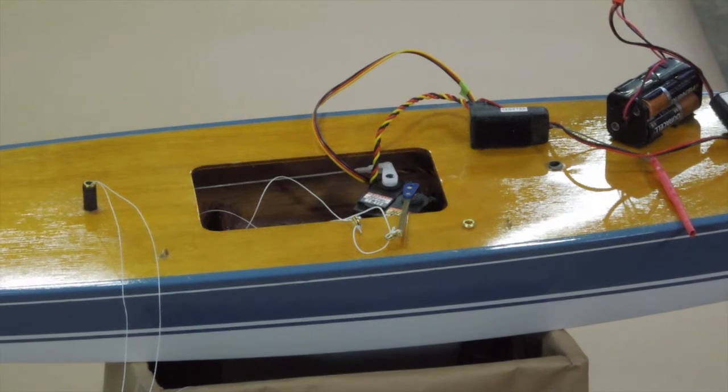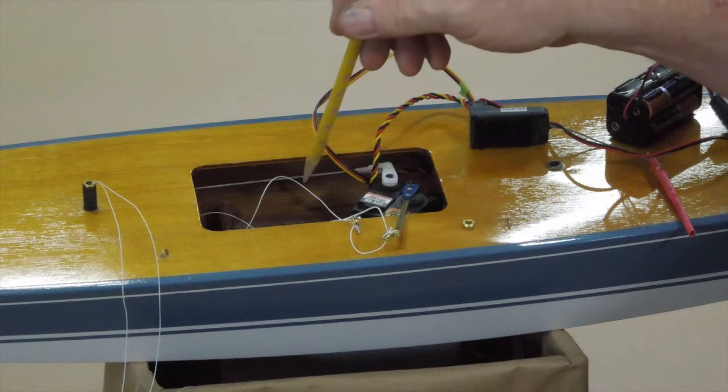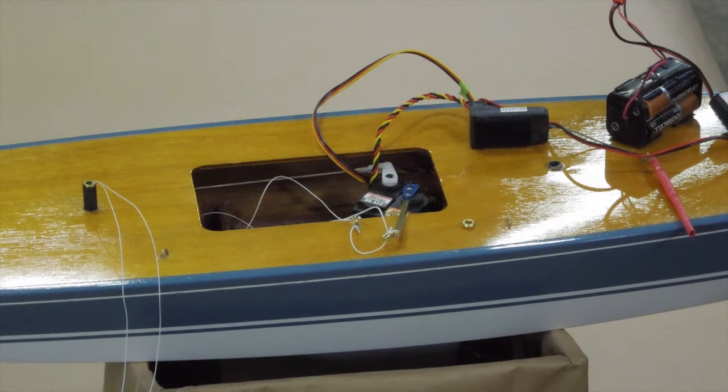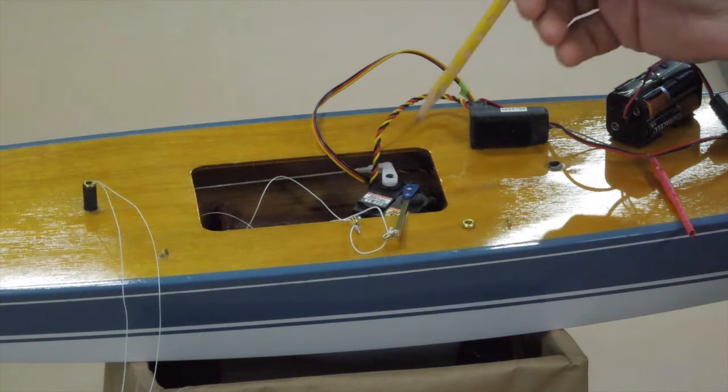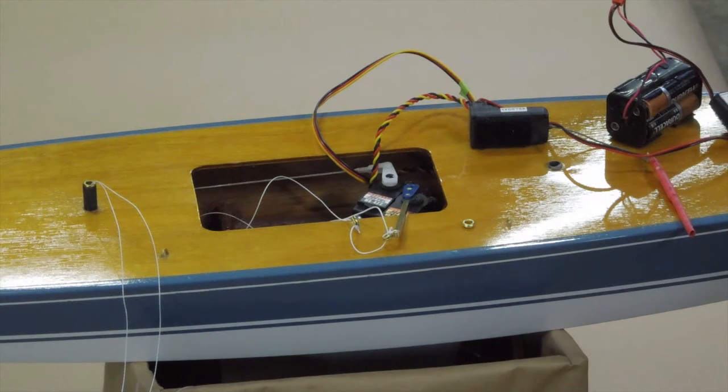Okay, T37 buildifiers out there. We're deep in the midst of rigging, so I thought I would show a couple things — show you how this is generally laid out and how the sail control works below deck. First off, I wanted to point out that you may have noticed that I turned my two servos sideways. The reason for that is that I decided I wanted to move the sail control servo forward and not change the length of this push rod. The reason for putting the servo forward is going to become clear in just a second.